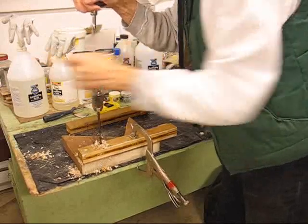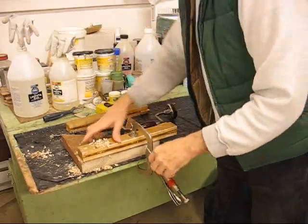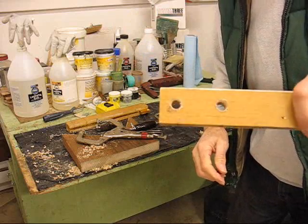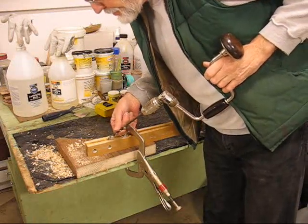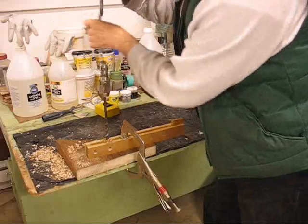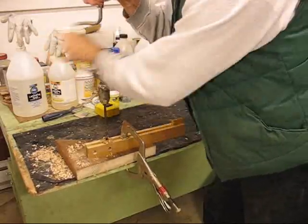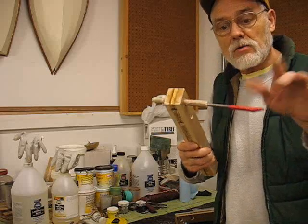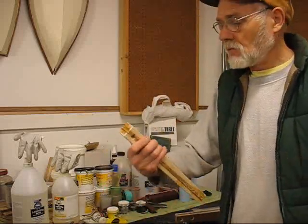I'm using five-sixteenths bolts and the half-inch holes give them enough room to move so they don't jam as you thread them in and out. I'm drilling a set of holes through this way, then through the sides, and then put in the toggle bolts. I'm using a brace bit with a half-inch bit, and now I'm through to my backing wood — you can tell by the different colors of wood coming up. To sand the inside, I took a piece of sandpaper wrapped around my rat-tail rasp and just swing it around — it sands out the interior.